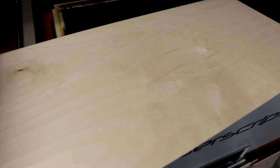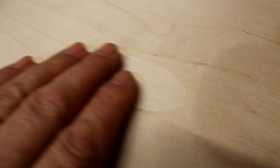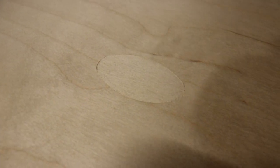Just selecting another piece of ply — the laser ply. One thing you have to watch out for is that because it's higher quality than normal, if there's some sort of blemish in the surface of the wood they cut it out carefully and replace it with another piece of veneer. Absolutely smooth, you'd never know. It really doesn't look like a normal knot, so I'm going to make sure I always check for that now, having made a few stupid mistakes.